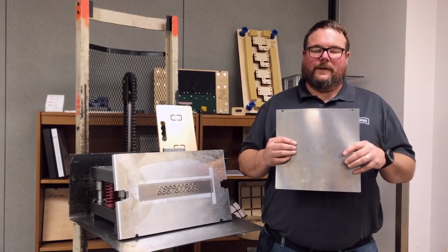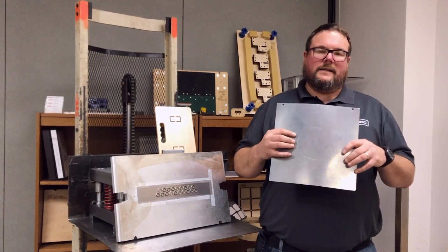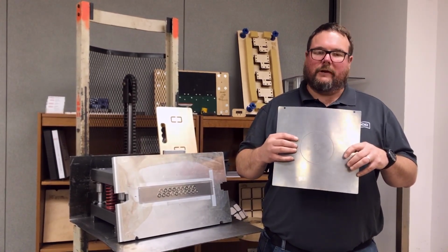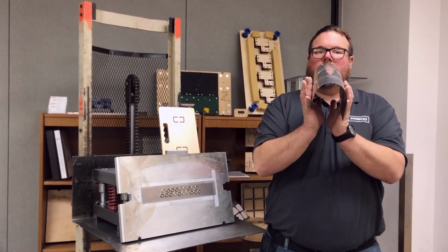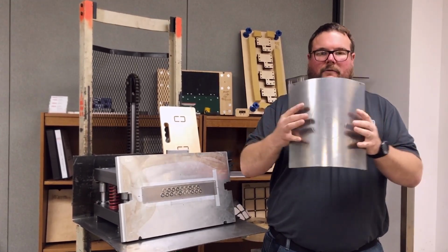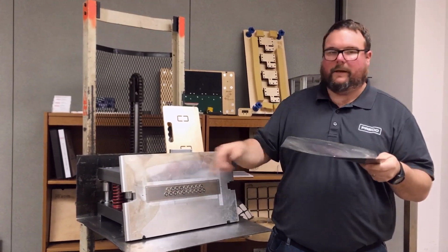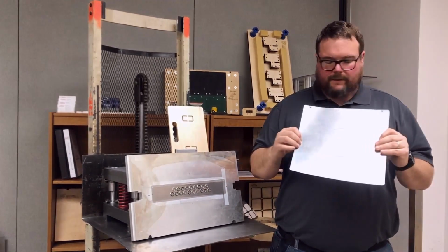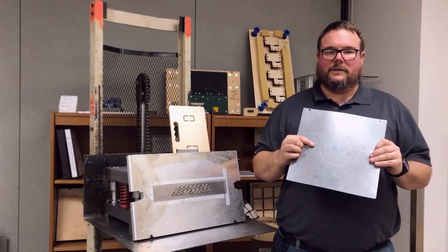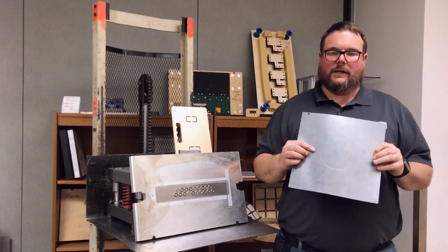Here's another really cool feature about chemically etched tooling on Preco die cutting equipment. The exact same tool that would be used on a Preco rotary die cutter with a magnetic cylinder can also be used on a Preco flatbed die cutter. It's just a matter of either wrapping the die around the cylinder or attaching it to the flat cutting plate. And remember, the same thing applies when you're using chemically etched tooling. Only use glassine make-ready tape on the back of your make-ready sheet.